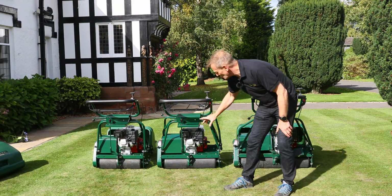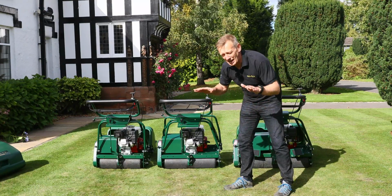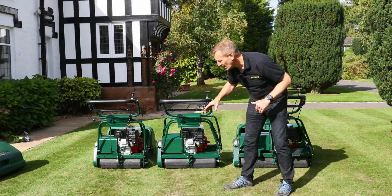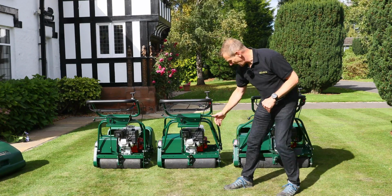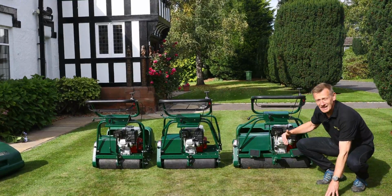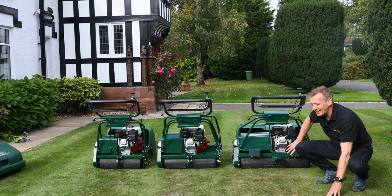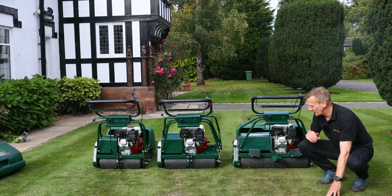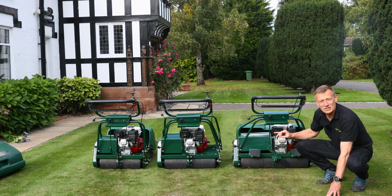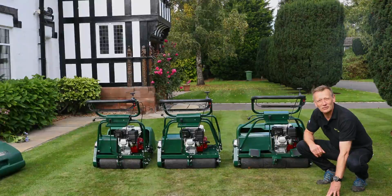We go for 2 sections on 20 and 24, and the reason we do that is because it helps with straight lining to be able to steer the mower, and when we turn at the end we don't want to be scuffing the turf. And when we go to the much wider 30-inch, splitting it in the middle is still just not going to be good enough, and we split that into 3-section, and that's got a full differential drive. That's not so easy to design and construct, but at Allett we consider it to be such an important part of the beautiful mowing that we achieve.